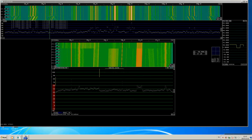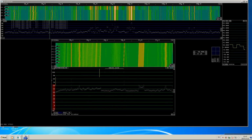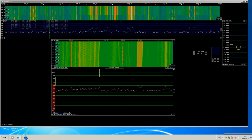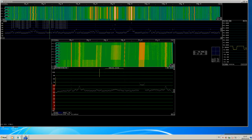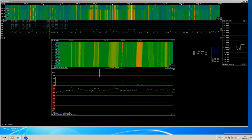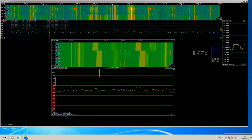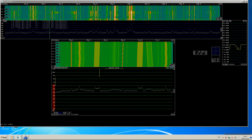Increase 10 dB. And you can see in the upper spectrum, the main spectrum, a lot of false signals, while the particular ones I was looking at have been reduced. So I go down and go down again, and go up, and then the other generator, increase the level, or decrease the level, decrease again. So what I can say is that minus 60 dBm, that's too much.